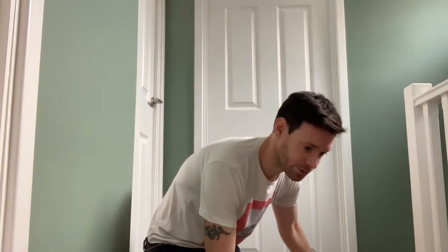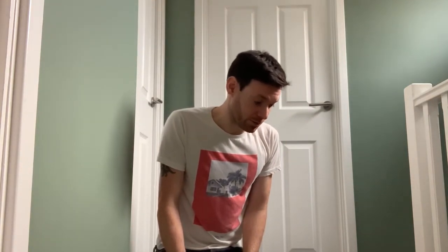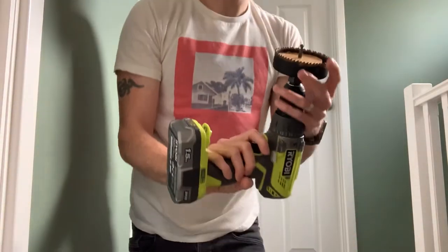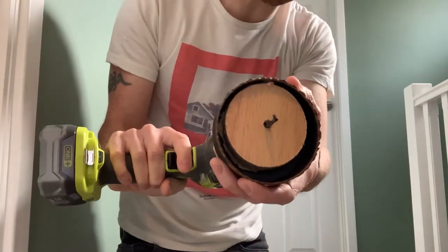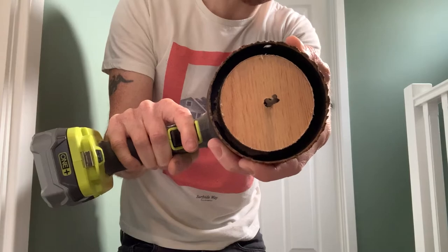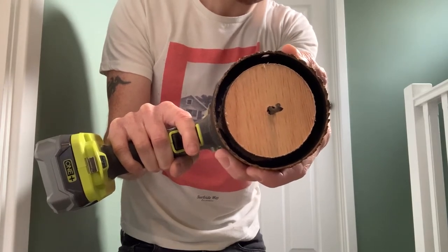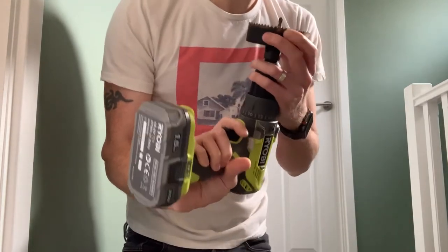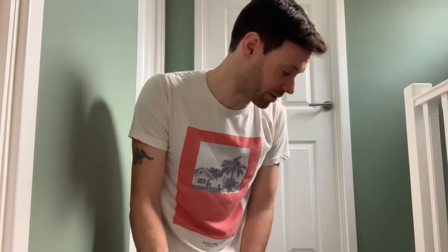Now, the issue I had was the hole that was originally cut was 70mm. The Ultimarc requires a 90mm hole. So for that to happen, I ended up cutting out the 70mm piece and used that as the center point. I then used the 90mm hole cutter that you can see here outside it, which ended up cutting the bigger hole. Now, it was a bit hacky, but it's done the job, and the trackball is thin and solid, it's there, it's not going to go anywhere.